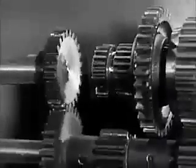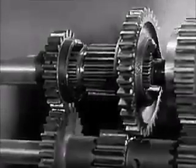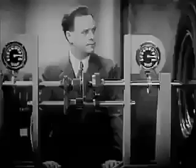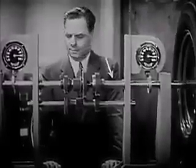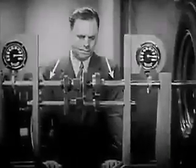For higher speed, we let the power go directly to the rear wheel. We shift the sleeve forward so that it meshes with the shaft from the engine. The power travels straight from the engine to the drive shaft. Now, the shaft to the wheels is turning at 90 revolutions a minute — the same speed as the engine.